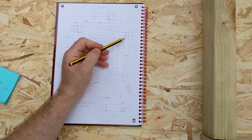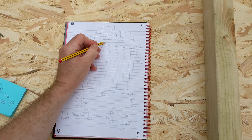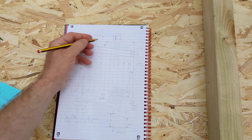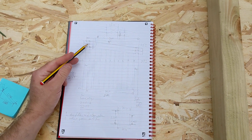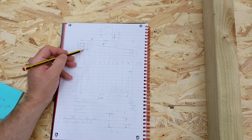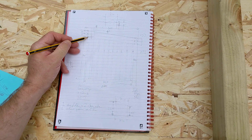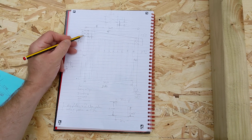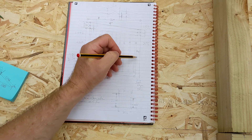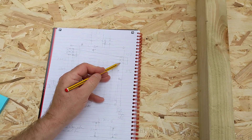I know the height of this side and the height of this side, and it's a 4-degree pitch on the roof because the roof specifies it has to be at least 4 degrees. What I did was work out the height of the long side first, which is the same as the front wall less 8mm because of the degree. Then the short side of this one is the same height as the back wall.